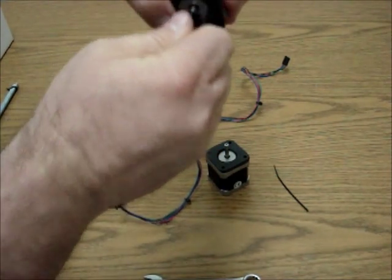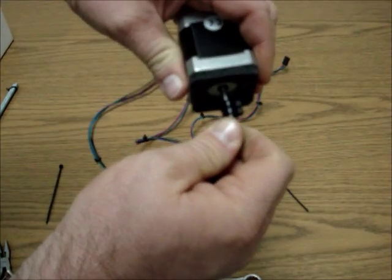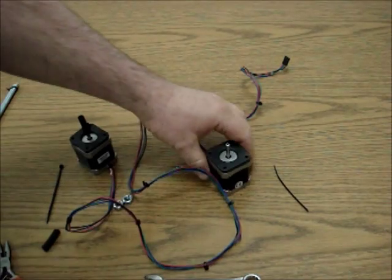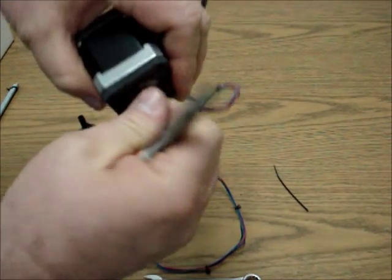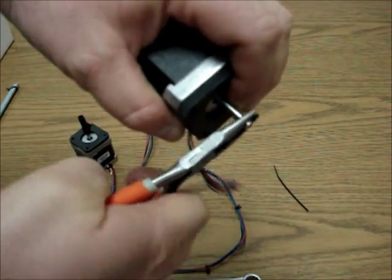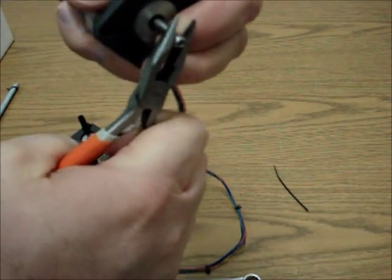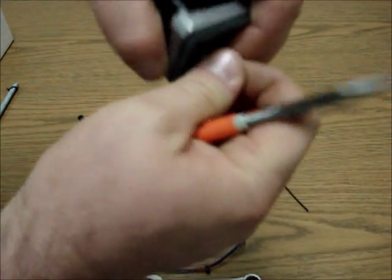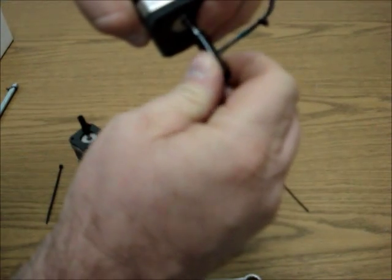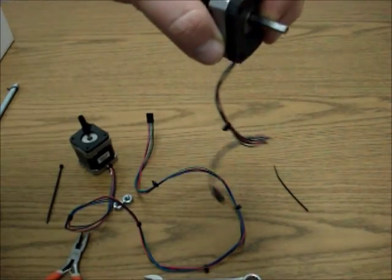One of the things you can do before that is - this is a precision ground shaft, but you can actually take your pliers and kind of scuff it up a little bit. It will be the only time I ever tell you to scuff up a precision ground shaft. Just muck it up a little bit - what that does is it gives it a little bit more to catch onto the vinyl tubing. Because without it, it spins too much if you don't actually put something in that D-flat.